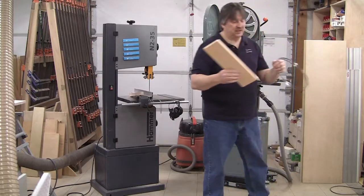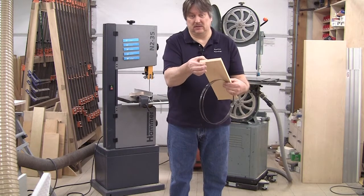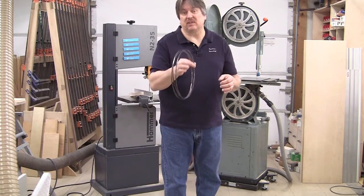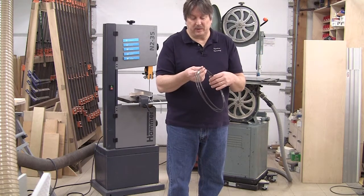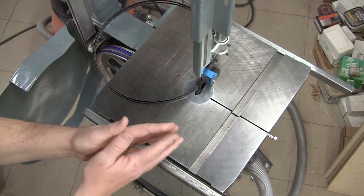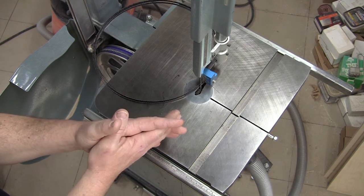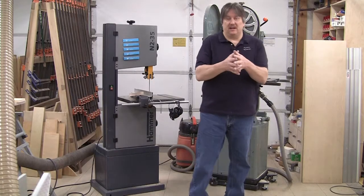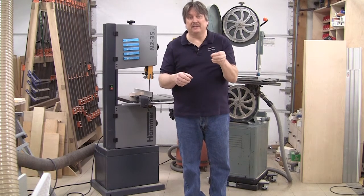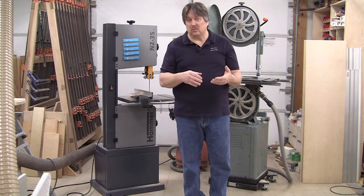And in order for those teeth to rake away the material in a board and have the blade of the saw pass through the material, we have to add set to the teeth. So what they do is, once they file the teeth in there, they then add set to them, which bends them outwards. The idea is, as those teeth rake down through the material, they're creating a path that is wider than the body of the blade. So it's the only way that a handsaw works.